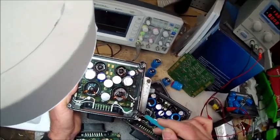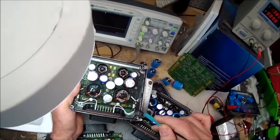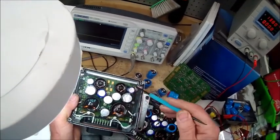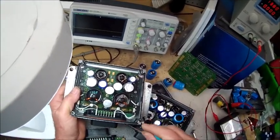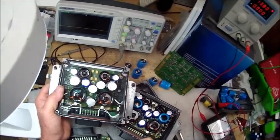The other cool thing with the design of the car - nothing that we did - is that if this fuse blows on the 180-volt line, the car will run on the 23-volt line like it's in limp mode. So it'll go up to 2,000 RPM and then won't go any faster than that. But at least if the fuse blows, you're not going to die out on the freeway or something like that - the car will go into limp mode.